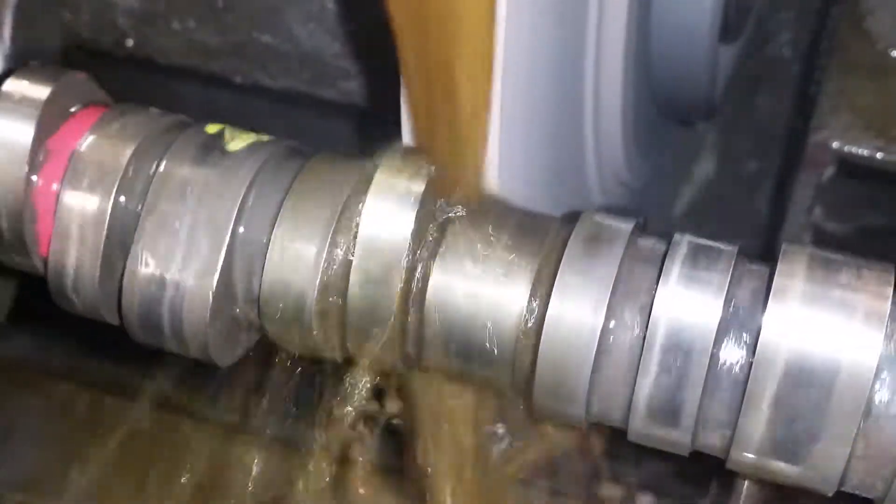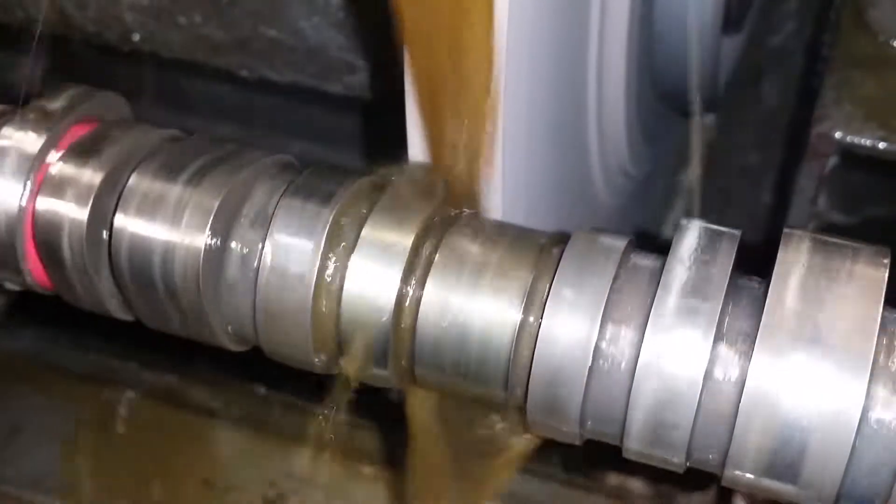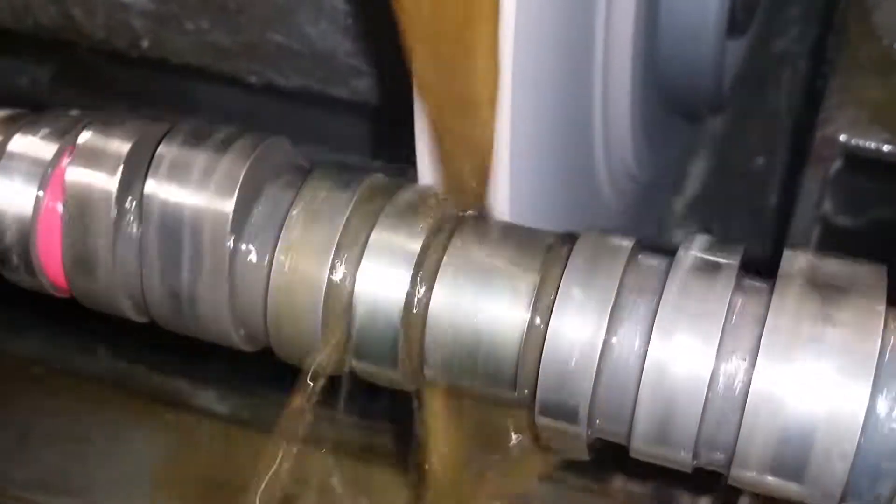See there? The wall was cleaned up. We'll let it spark out to ensure that the tooling is being properly tracked. Remove the grinding wheel at the top of the lobe and go over to number two cylinder.